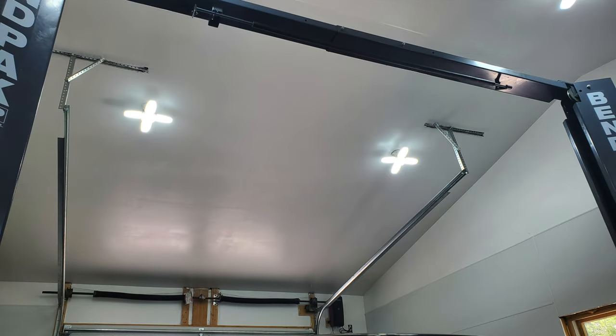As far as honorable mentions, first is a garage door opener. If you look at my ceiling, there's no traditional style garage door opener in the middle of the ceiling that a vehicle could run into. I use a jack shaft style opener that basically just turns the shaft the garage door springs are connected to — that's how the door goes up and down.